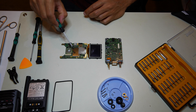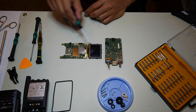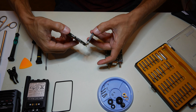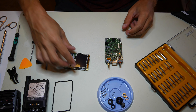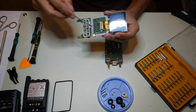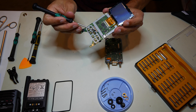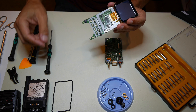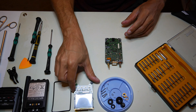So this is one set of processors and memory, and then under here is the other one, and then the DSP. This is the Bluetooth module that was added on this radio, and maybe that's one reason they moved the GPS up top — they needed room for the Bluetooth module. The processor and everything is almost identical to the FT2D; they just tweaked things to add the color screen. One notable thing: this is the Bluetooth antenna soldered on the board. The microphone is also on the board in this radio, whereas in the FT2D the microphone is actually in the case.